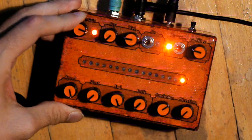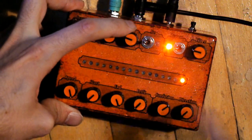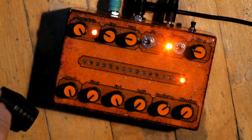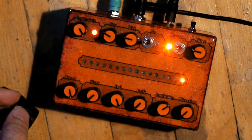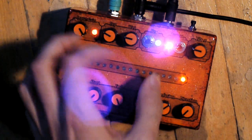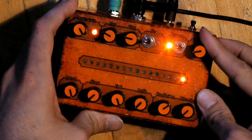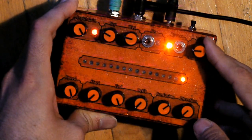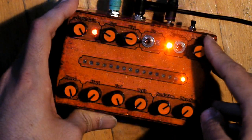You've got your input gain here, just so that your input isn't too hot. You've got your dry signal — clean, dry — and you've got your wet, which is the looped sound. It's kind of an archaic design, it isn't meant to be a traditional guitar looper or whatever. It's got a bypass toggle switch, and it records when the LED is on — that means it's recording. And you've got your filter up here, it's a low-pass filter. So it can be used as part of the effect, or you can use it to sort of get rid of digital aliasing.